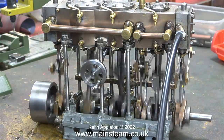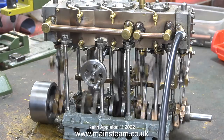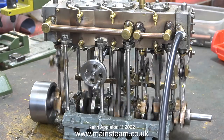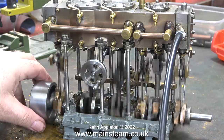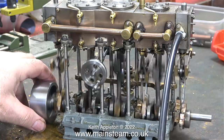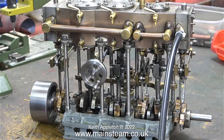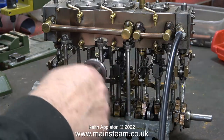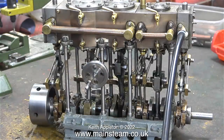When all said and done, this is a steam engine — quite a clever steam engine. I think there's possibly only a steam engine that would run in this mechanical condition. The good thing about a compound engine, in this case a triple expansion compound engine, is that the steam is split between three cylinders. On this engine, the bore of the high pressure cylinder is only three quarters of an inch, exactly the same as on a number 10 steam engine.